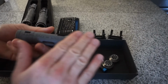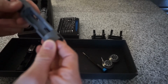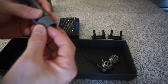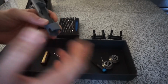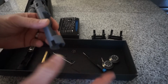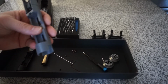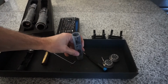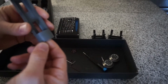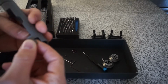And then, like I said, I'll take a Scotch-Brite pad and just smooth out this surface. And the other thing, I print these up like that. On both a regular plastic FDM printer or a resin-based printer, if you print on the build plate like that, you get what's called an elephant's foot, right? That first layer of filament kind of presses down.